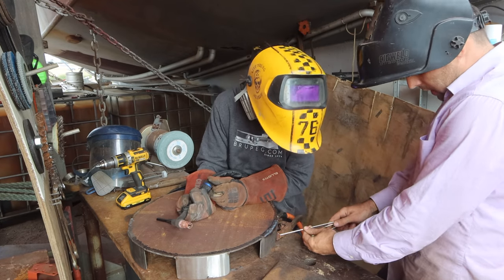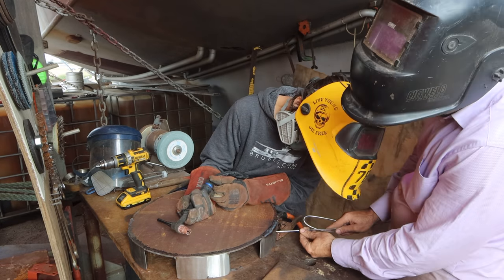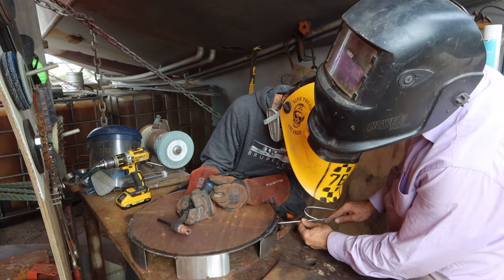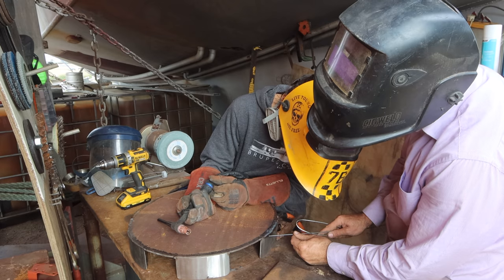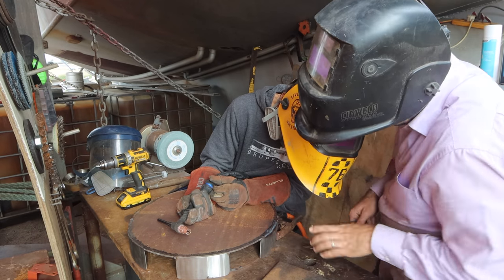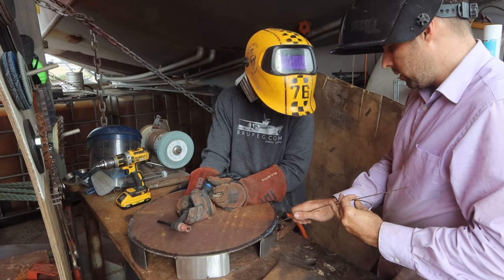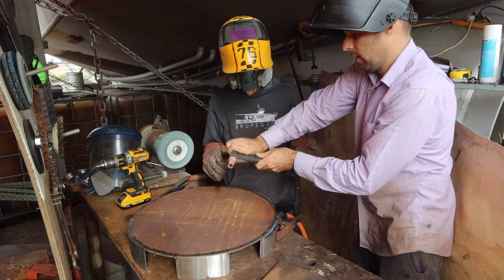Right, okay. So look at your heat down here. See how it's much more even? You've got a straight line compared to your big bowl. You're at the right speed. So you can get it tighter by moving a bit faster. Now, your gun is sort of like that, whereas if you aimed it like that, you'd get more like that.